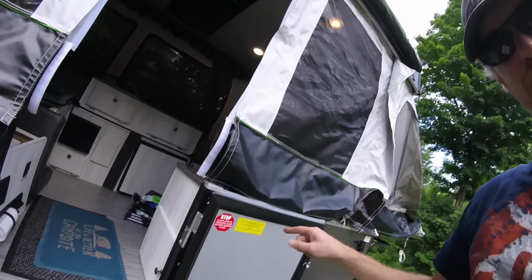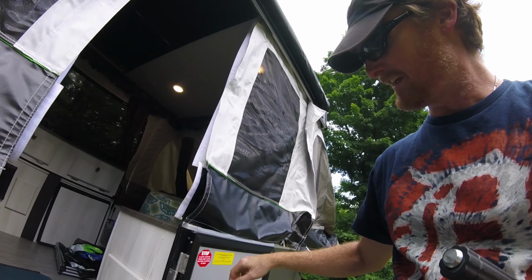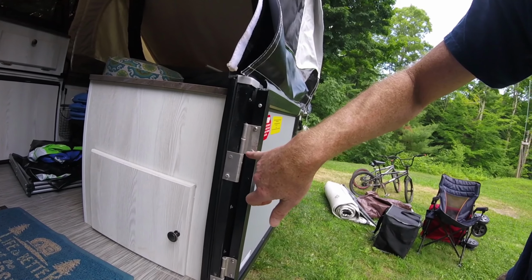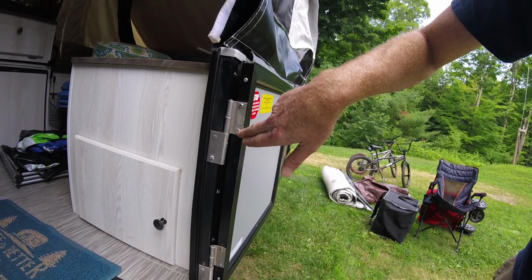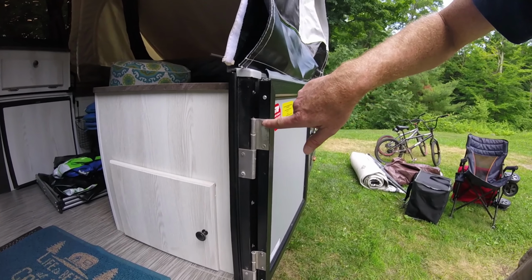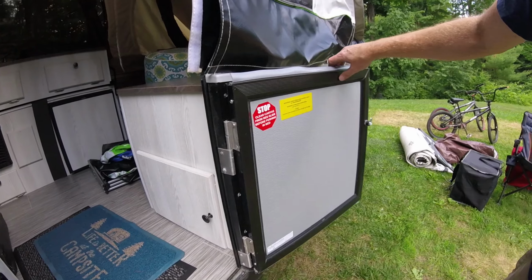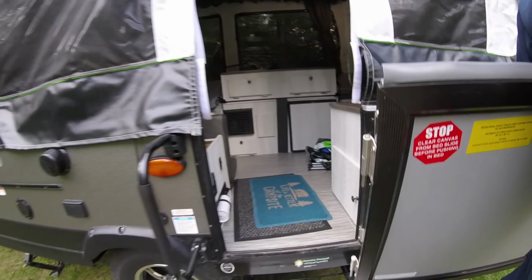There was one other thing. This door was completely bent. These hinges were so bent, I could barely get it on there without a lot of strength. This hole was so completely stripped out, even a larger screw wouldn't fit in without interference. So I cleaned it all up. I had to bend all of these things straight again and buy new screws. These are stainless, and I re-tapped with a larger screw. And this one was stripped out so bad, I used a large pop rivet. But I got it perfectly straight. The door closes great now, and it comes off without any effort.